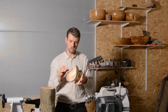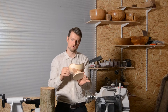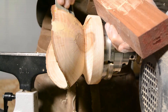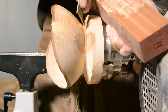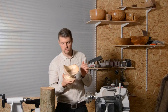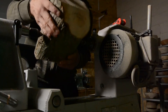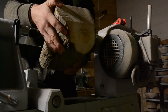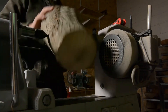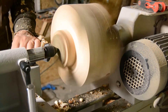As I usually do, I started off by cutting off the end sections to remove most of the cracks. Granted, I have a crack in here that I filled with some chemical wood, two component stuff, on both sides actually. Drilled a hole for my drive center and got to work, so I started off very roughly rounding the bottom and created a tenon for my four-inch jaws.